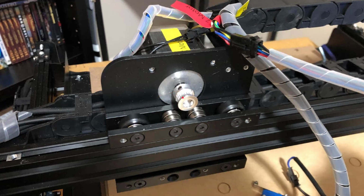So we pulled the belt out, nothing special. It should be loose on both ends already, so you can just remove the old black belt. And we want to replace the 4 wheels, so the 2 on top, and there's also 2 on the bottom. Having walked through this, I found it easiest to replace the 2 bottom wheels first. They are a little bit easier to get to.